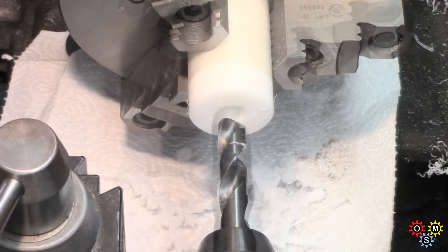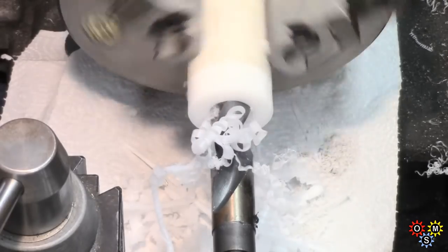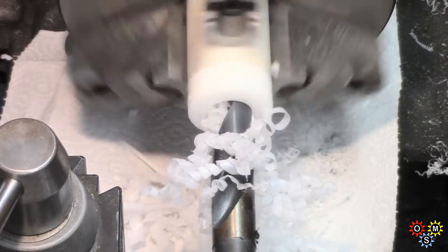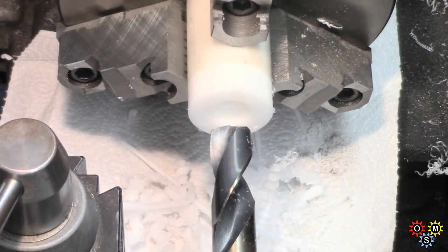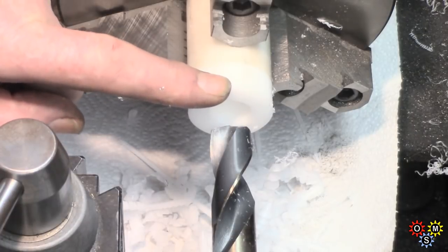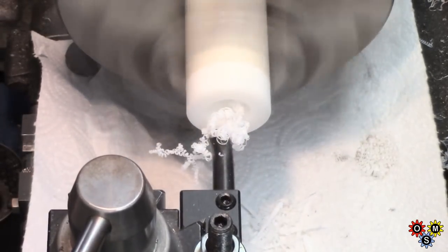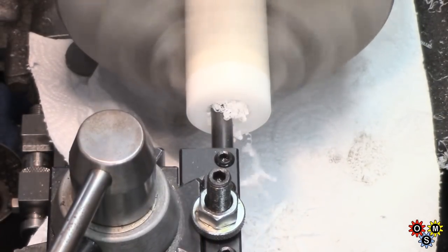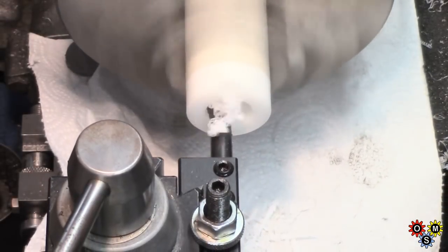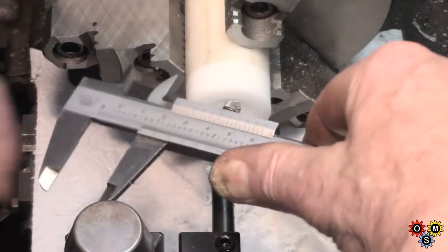I've got to go a little bit further. Actually, I've gone up to 3/4, although this drill has a slightly asymmetric grind, but it doesn't really matter. Right, well, that'll speed things up. Just take a little bit out of that, only about 50 thou each side. Just do a rough check on this real quick.